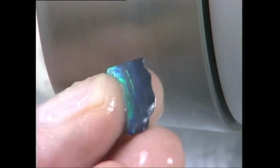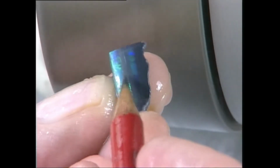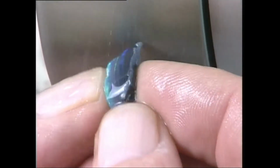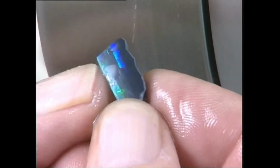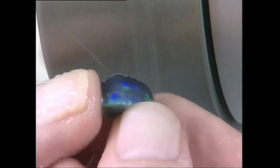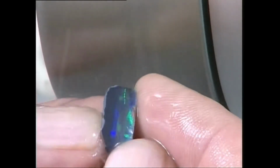You see the back here, we're very thick on this side. Very thin or virtually no back at all on this side. Bit of a hole in there. So we'll start from the high point here, bringing this back up into a setting edge. Working at approximately the angle you want to finish the back at. Just grinding it up, bringing the edge up. See our angle there. Still a long way to go with the back of this stone, of course.